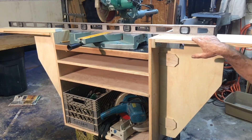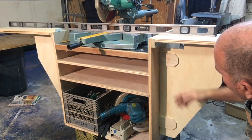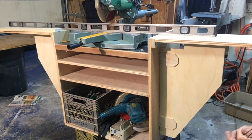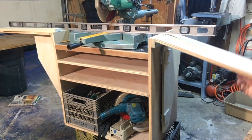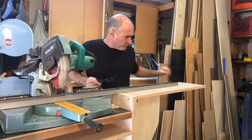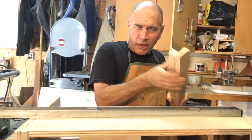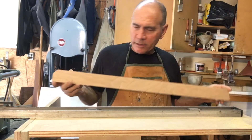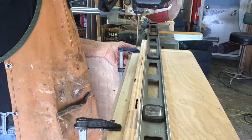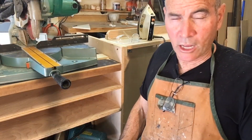This is my final solution for my extension table: I used three-quarter inch plywood here and half-inch plywood here. I needed to put a block right here to give myself some space for my brace, and some little blocks of wood here for the hinges — this is gonna flip back like that and drop down like that, and it's gonna work great. The last thing I need to do is make a little fence for my extension table. I came up with a three-quarter inch piece of plywood nailed to a piece of solid wood, and this gets screwed on to my extension table.